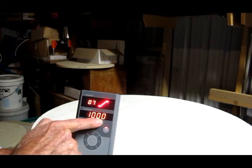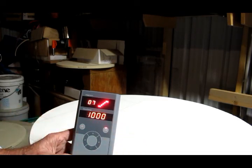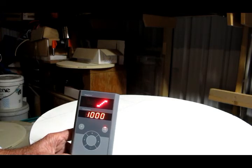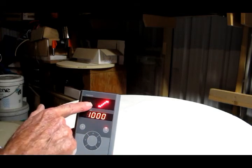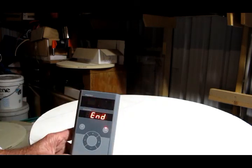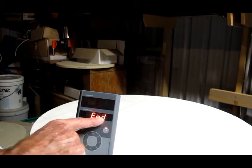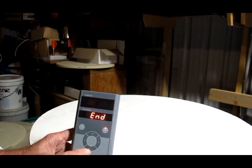Right arrow — the time setting is now four hours, and the temperature setting is 1000°C. So over the next four hours we go from 550 to 1000 degrees Celsius. That's step seven. Step eight is the finish — once it's reached 1000 degrees Celsius, we want to finish our program and let the kiln cool down on its own.